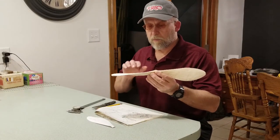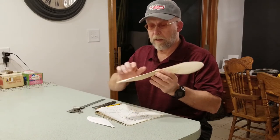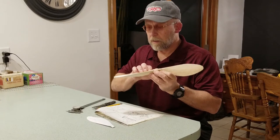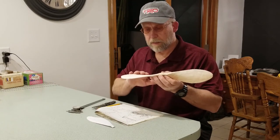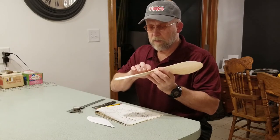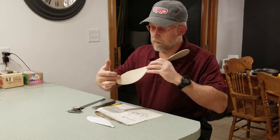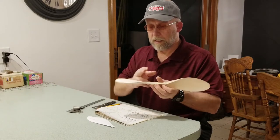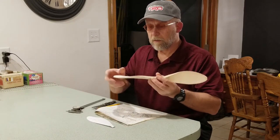What this does for me is it gives me an accurate reference point down the length of both blades when I'm carving and sanding the leading and trailing edge. I can reference from the high point to the leading and trailing edge that I have accurately established along this pitch on the backside.